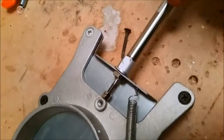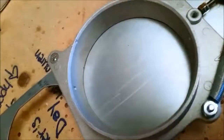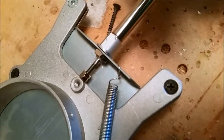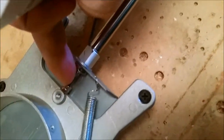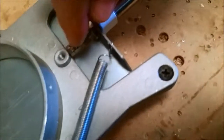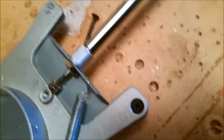Again, very simple solution to building a gate. It's simply a hole at the top with the cylinder attached. You'll notice I have a washer here — that's to give enough distance to allow the gate to close fully. Then it's just the pressure of the cylinder closing the gate. At the end I took the nuts and attached them to give a little more surface area to push on the structure.